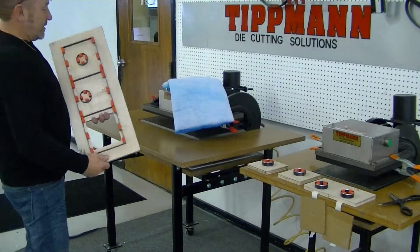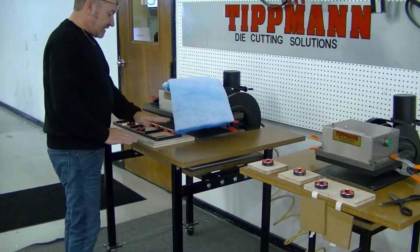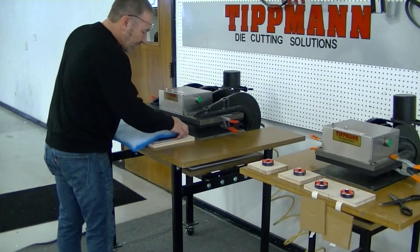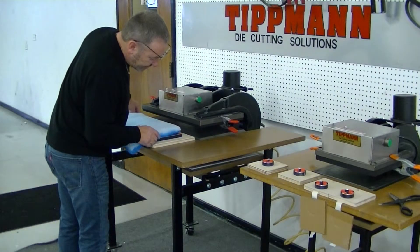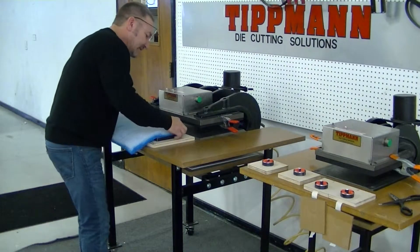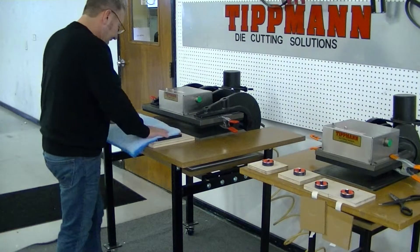It's going to work out pretty nice for you I think. I'm going to test it right here for you. I've got one of each — I've got the blank, I've got the offset, and I've got the center circle. You're going to lay your material right on top of this where you'll be able to get two cuts out of this if your material is 12 inches. What you want to do is lay this right up against your blade on this side, on the top side there, and you should be able to slide this right in.